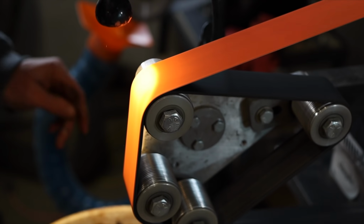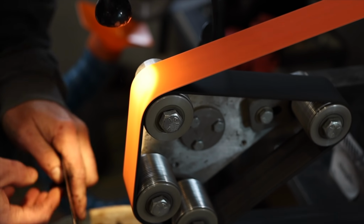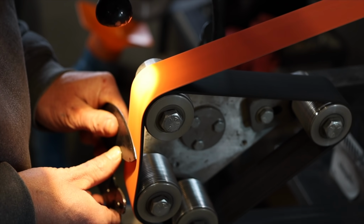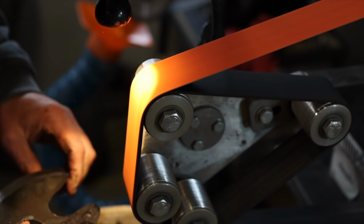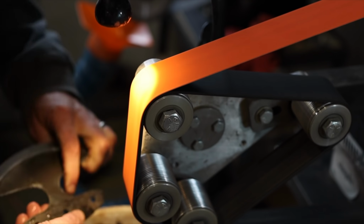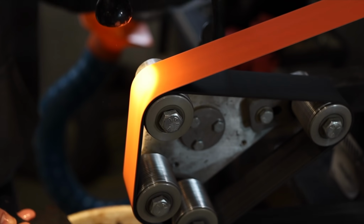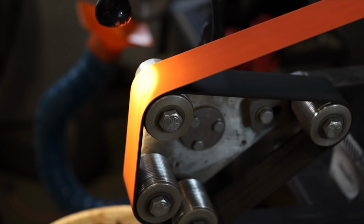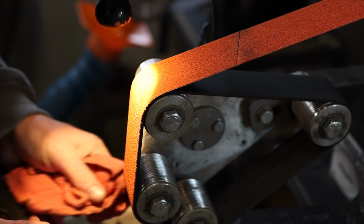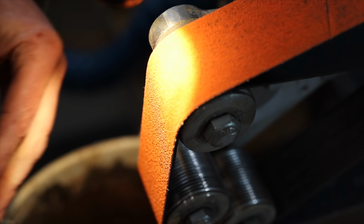The original blade was very blunt, so I'm just rounding that over. I really liked what I was getting with the rotary platen here. I ended up switching to the closer wheels, so there was a little less deflection in the middle, but something like this is a great application for this tool. I typically use my rotary platen for handle shaping, and I do in this video later on as well, but for things like this, just getting a nice rounded, convexed grind, it works so good. And there was the original bevel, and here's what we end up with.